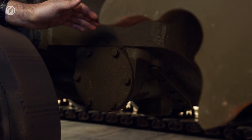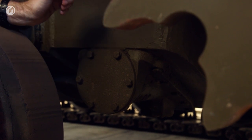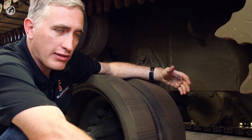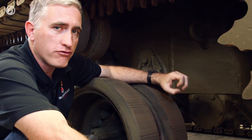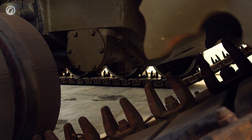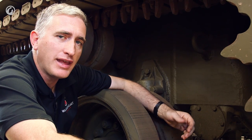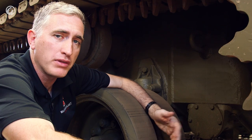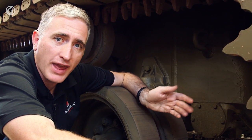What we have here is what my cameraman called a vestigial tail. This used to be the mounting point for a track tension idler — effectively a return roller on a road wheel arm with a torsion bar spring, designed to apply pressure to the track and keep it tensioned. It turned out to be completely unnecessary and was removed from the vehicle after a while, though you will see it on pictures of some vehicles in the field and on American heavy tanks of World War II. A few even lasted out until the M48s.